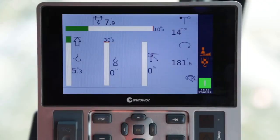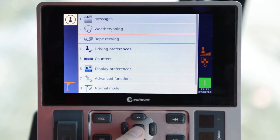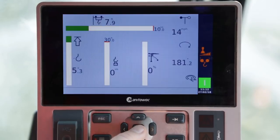Press the Escape button on the indicator screen. Select Menu 1, Driving, and confirm using the OK button. Then select Menu 3, Rope Reaving, using the down arrow button, then the OK button. Select the Rope Reaving Type you want to change using the right or left arrow button, then continue by pressing OK. Confirm with Yes or No, and return to the indicator screen by pressing Escape. The Rope Reaving change will appear on the right-hand bar. The mechanical rope reaving needs to be changed following this.